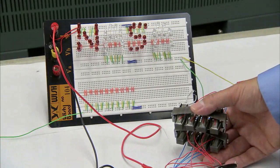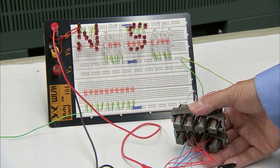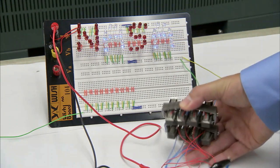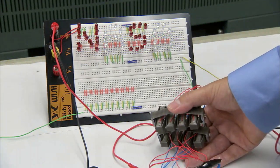The second demonstration uses the piezoelectric energy harvester to light up about 50 LEDs in two colors that spell out NASA. As we compress the energy harvester, it generates enough voltage to directly light up the LEDs. We use two stacks in this case because we're generating AC voltage, and every other LED is connected in opposite phase so that half light up when the generated voltage is positive and the other half light up when it is negative. Based on the voltage requirements of the LEDs used, we estimated about 700 milliwatts of power were generated on each compression cycle to actually light up the LEDs.